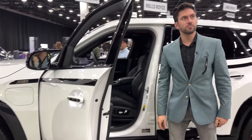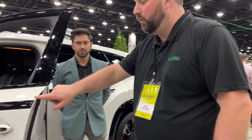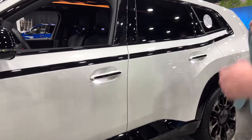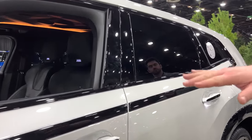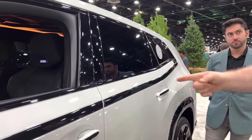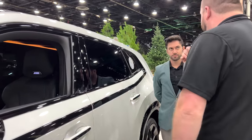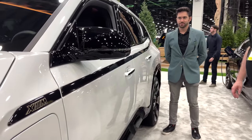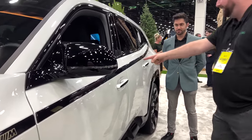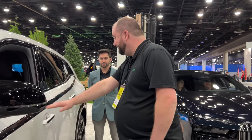In one of the earlier videos, I mentioned how I had been in a design studio with representation from many different commodities, and we would literally spend hours arguing over one millimeter. This is one of those one or two millimeter situations. We need to know between the trim manufacturer what their capabilities are, between the door manufacturer what their capabilities are, what the overall look studio wants, how manufacturing is going to install this to the vehicle, and what their tolerance is. Because if this went right to the edge but happens to be one millimeter too long, you have tolerance issues on one side or the other. We would literally fight over those tiny slivers. That is where all of the labor and man hours winds up being in developing this part — not the surface itself. That is easy. The tolerancing and fit — that is hard.